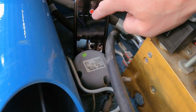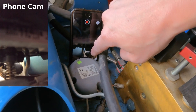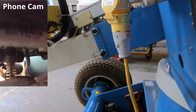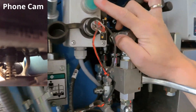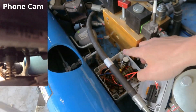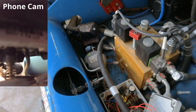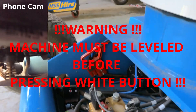I'll try to run a calibration and see through my phone if that LED is going to flash. To do the calibration, you have to have the boom all the way down. Then press the green button and press the white button right here in the box. Hold it for seven seconds, release the button, and that LED should start flashing — the LED flashes only on the release of the white button.